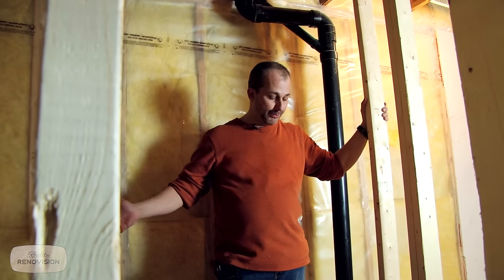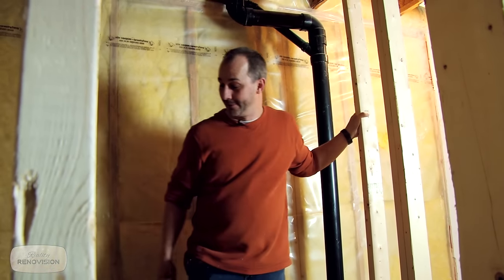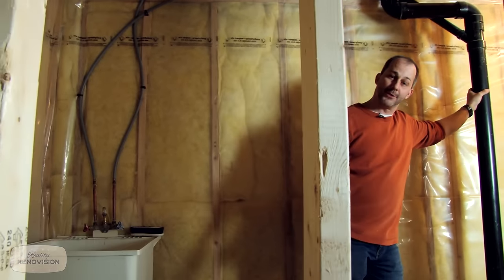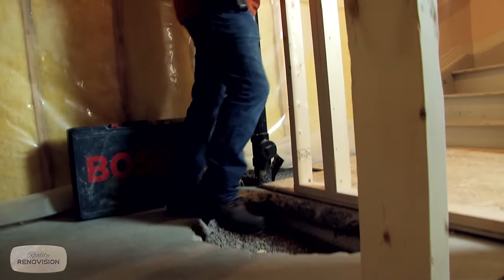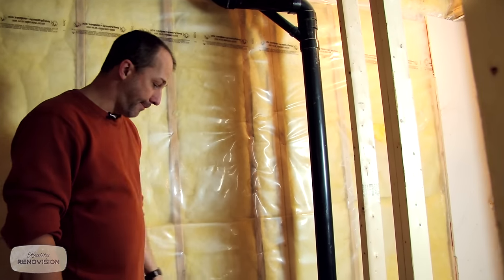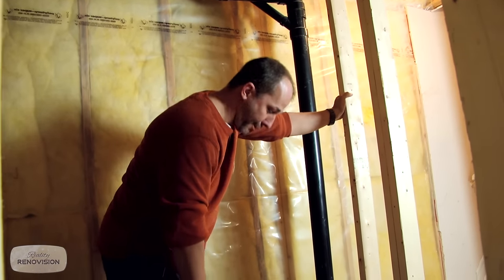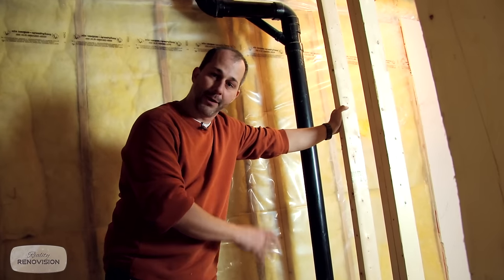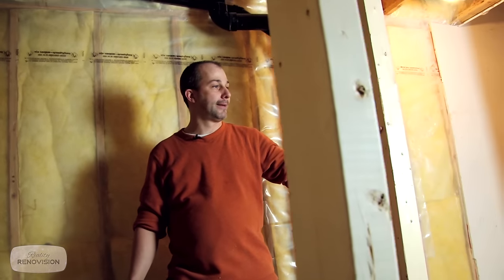One important thing to consider in a basement renovation is the bathroom rough-in. Lots of basements nowadays have pipes already pre-placed underneath the concrete, and there's a lot of temptation to finish the job without getting a city inspector involved. We don't advise that — get the inspection, it's worth its weight in gold. Here we have a laundry sink and the stack was convenient because the client wants a two-piece bath, so we framed it in simply. We opened up the hole to identify where the pipe is — it's PVC, not ABS like the stack pipe, and you need a special glue to connect those two together. We used a Bosch chipper to open the hole and dig out the gravel. The plumber will do all the rough-in, then we call the city and a plumbing inspector will come by; once he gives the okay to close up, we'll be back next week to drywall.